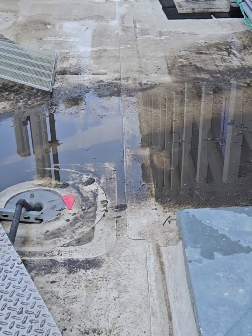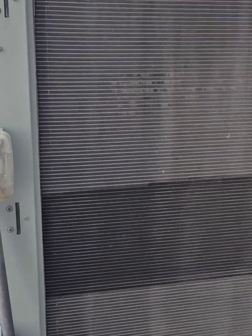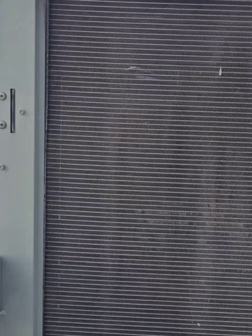This is just what's left on the roof from what went down the drain — but my god, this thing was filthy. What's kind of cool is you can actually see where the discharge side and the saturation slash liquid side is. That's going to be your saturation where it starts turning into liquid — if not already liquid. There's the other circuit because this is a two-circuit unit. You can see where the discharge line is and then where it cools off because it's removing the heat — it's not evaporating the water as fast. Kind of gives you a cool visual of basically the high-side refrigeration circuit.